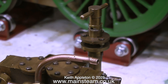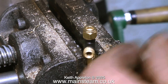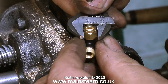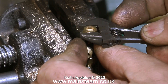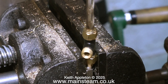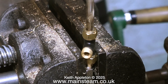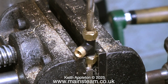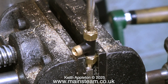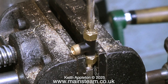All I need now is an adapter, so I'm using a commercial tee piece and I'm going to butcher it. I could make one from scratch but this is just quicker and anything that saves time is a good thing. I'm doing this job in the drilling machine and leaving the union nuts in place makes it really easy to hold the part in the machine vice. I'm drilling through the fitting using a seven thirty-seconds of an inch drill, which is tapping size for a quarter by forty threads per inch.